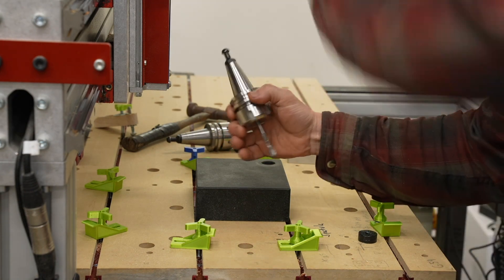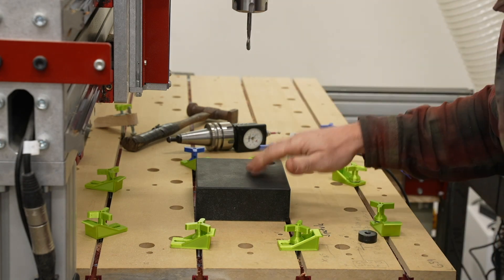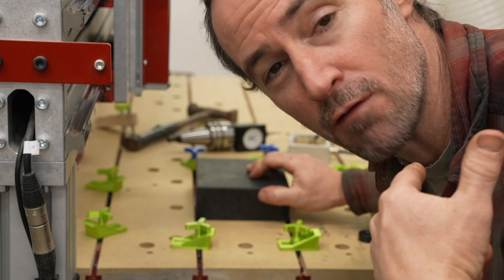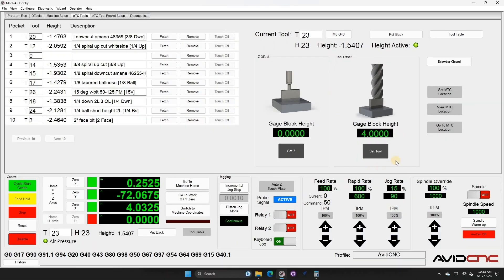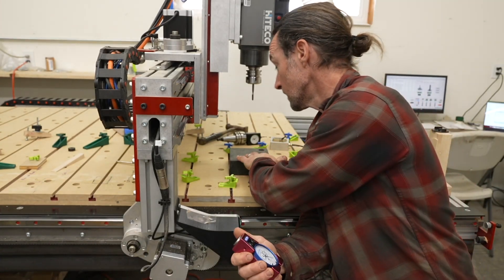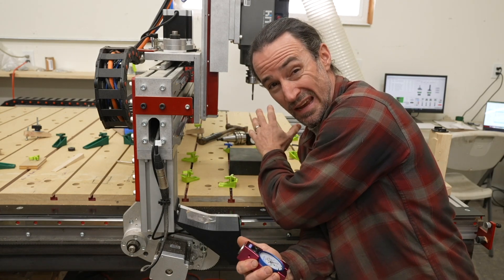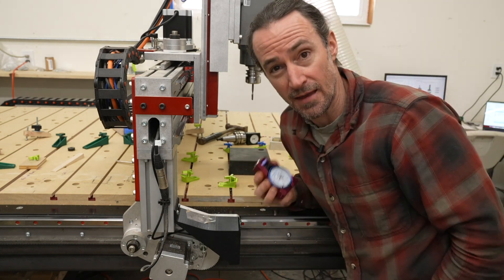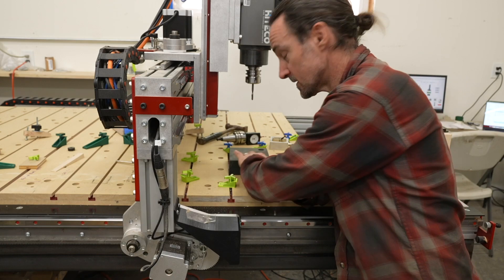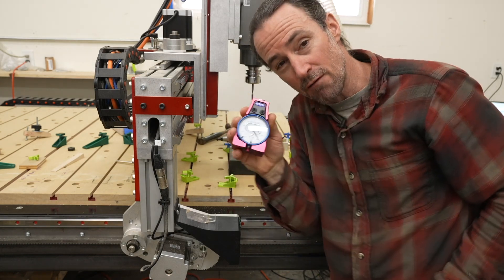Take my reference tool out and put in the tool I want to measure the height for. I'm going to go to the machine and tell the software that tool 23 is now in the spindle — whenever you're setting a tool height, you have to tell the machine what tool it has. There are a lot of ways to find when the bit is right at the surface. I like to use one of these gauge blocks, which I'll link to in the description — it's exactly four inches tall and we're going to set the tool off based on that height. You could also use a piece of paper as your gauge block, but I find this is a lot more accurate and consistent.